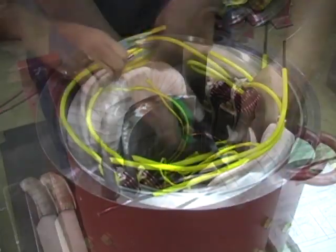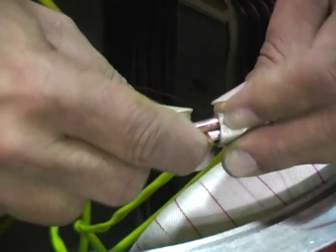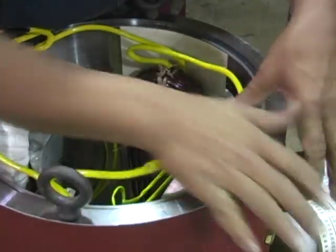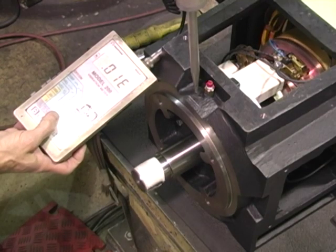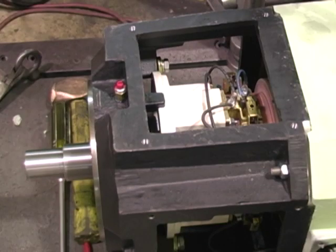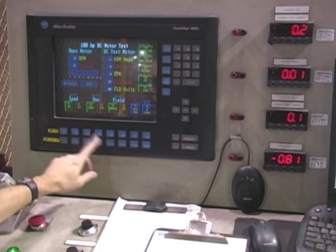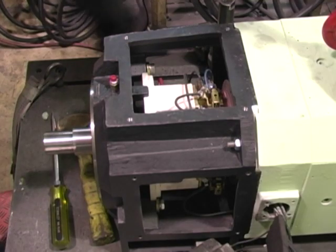Internal connections are secured and insulated. The DC motor is set up for final test. Brushes are seated for optimum commutation. All DC motors are tested at no load and full load at rated voltage, base speed, and field weakened speed. Neutral is set for same speed capability in either direction of rotation.